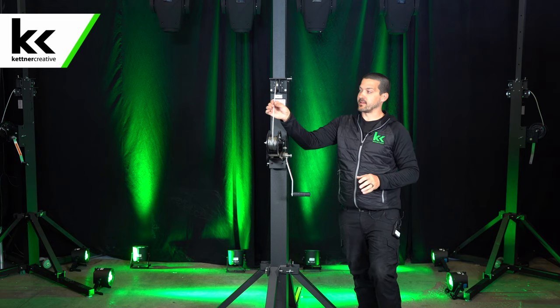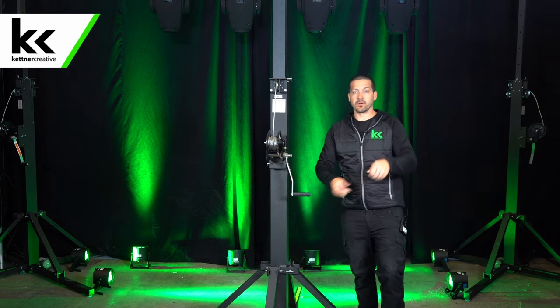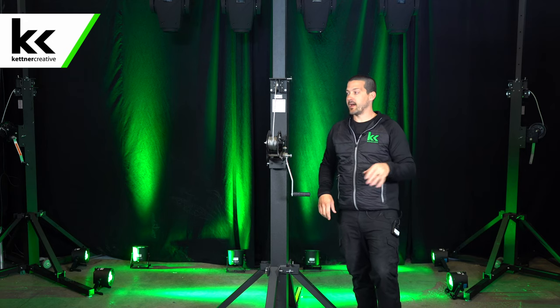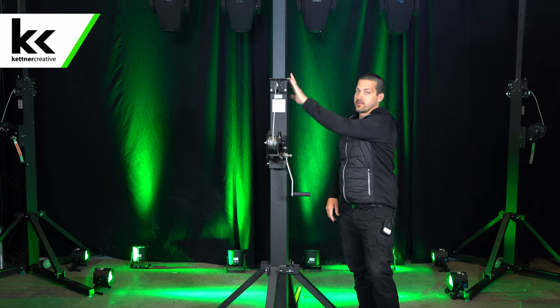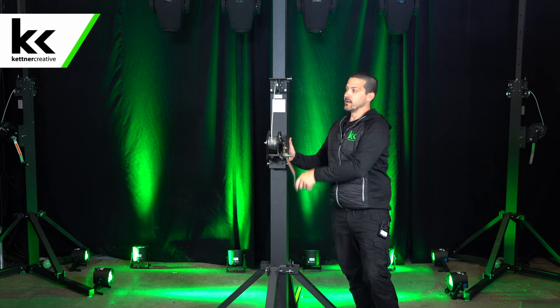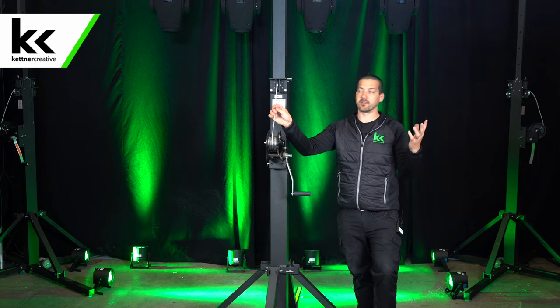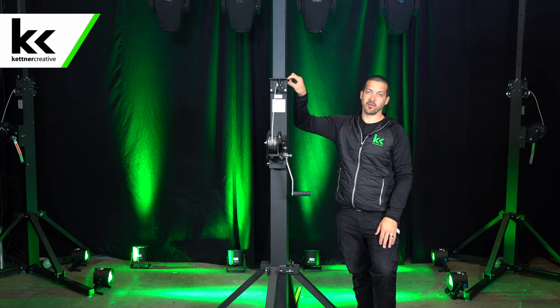I leave about an inch of slack in the cable — you can see we've done that on the others as well. I don't completely undo it, because if any of these pins fail — which they're not supposed to — I still want this wire to catch it. So I want it close. I just don't want the wire holding the load of the system. The load is supposed to be resting on the pins.